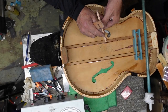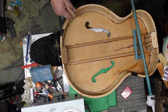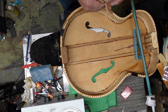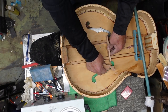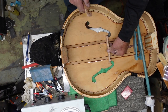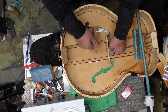All right, there's a B here and a T here, bass, treble, one on each side. This flips up. The heavy strings are here. The bass side is here. So we just fit that right there. Notice how that crack just basically disappeared. We are going to glue that up and move this back just a little bit. You see, these things are nice and tight. That's what you want. They glue to the brace.